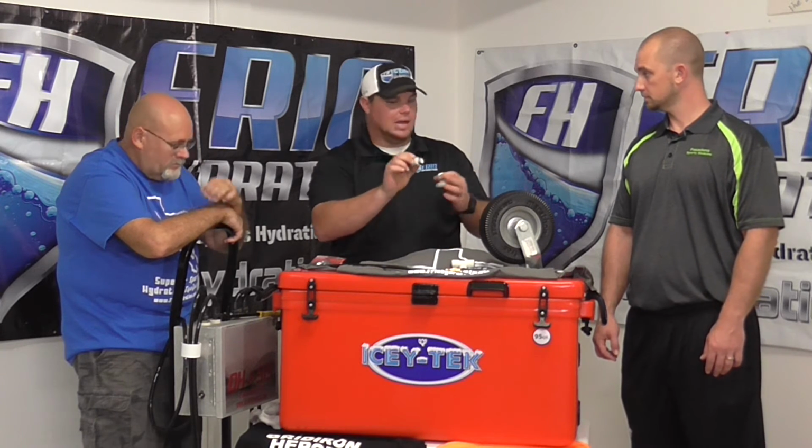What you have on this side, two sizes that are going to matter, the first is your tube side. The tube side, most common dimensions are going to be 1/4, 3/8, or 1/2 inch. Then you've got your thread side. Most common dimensions are 1/4, 3/8, and 1/2 inch. That's going to matter to you if you're screwing this into another fitting, whatever the case is.